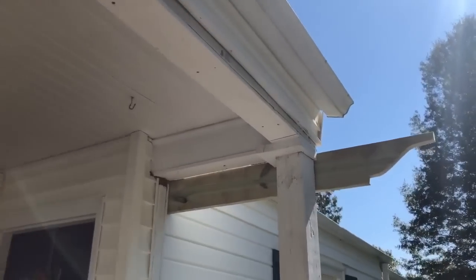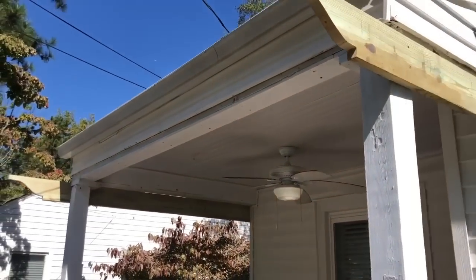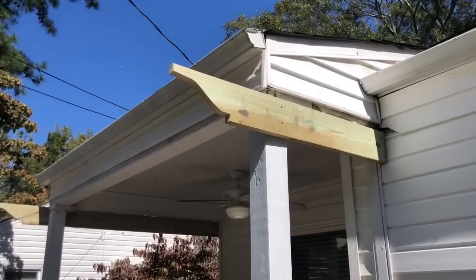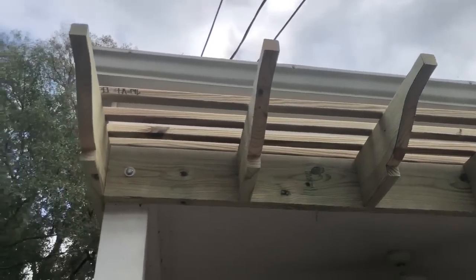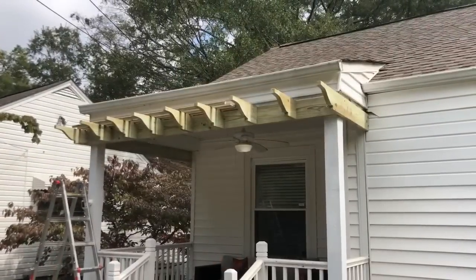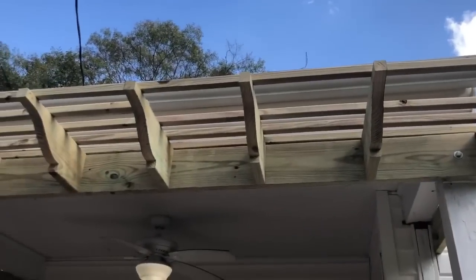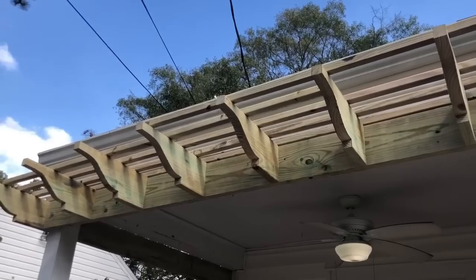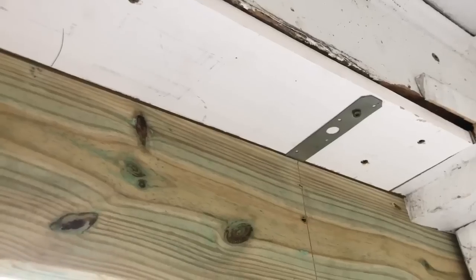You can see what I was talking about — those pieces going all the way to the side of the house are being supported by the support poles that hold up the front porch. What's great is that this is purely decorative and does not affect the side of the house at all. From the street you can already see how it's starting to shape up — I love the way this is going to look, especially with those blue shutters. The decorative pieces coming out were cut from those two-by-eights to the same shape as the end pieces. For the two-by-twos, we started putting those across the top of the pergola — we did five rows in total. We added some metal strapping to the tops of each decorative piece, and those feed through the column, screwed right to the top of the post.